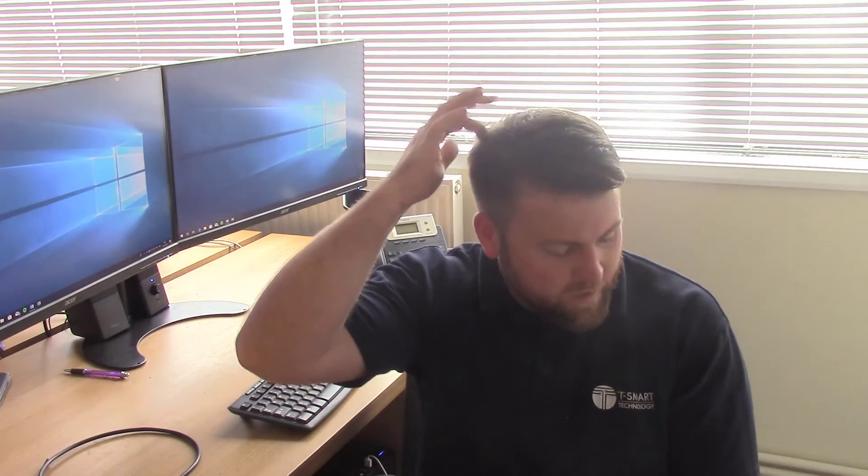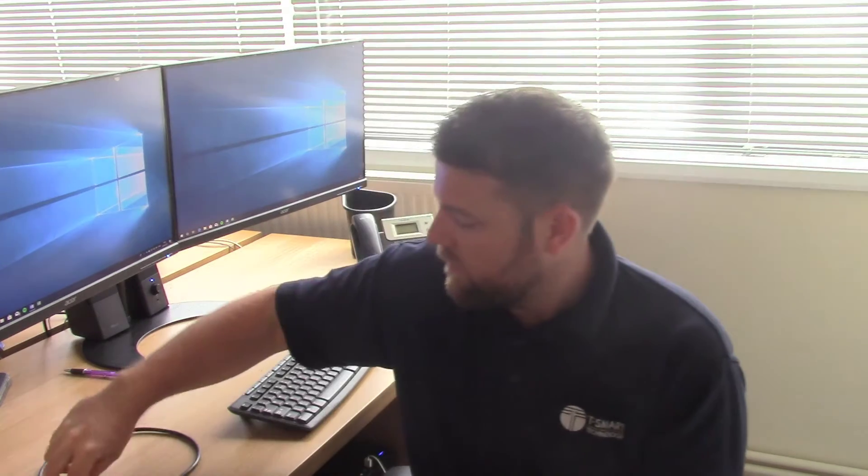Most traditional aerial satellite systems would use RG6. In the UK we have a very negative connotation around RG6 because over here we have cable manufacturers which brands one of their cables RG6 and it's a cheap, nasty cable. It doesn't matter that the original RG6 standard calls for a centre copper conductor — not a lot of people are aware of that in the UK. So WF100, CT100, all that sort of stuff — that's really the cable you want to be using for TV, satellite, and video systems. But what's common in the CCTV world is they don't use this cable typically, although you can; they use RG59 cable and I've got a piece here.